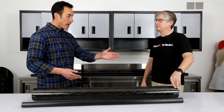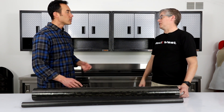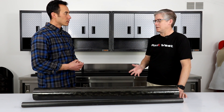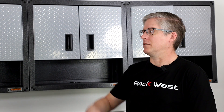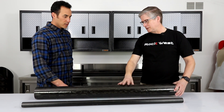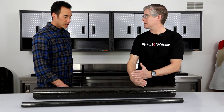You can wrap carbon fiber or fiberglass in whatever pattern you want depending on what kind of strength you need from the tube. We focus on three different strengths. The most common is the torque tube — these can be used in race cars where a drive shaft needs a lot of torque. This tube right here would make a good torque tube because all the fibers are at 45-degree angles, giving really good torque no matter which direction you're spinning the drive shaft.